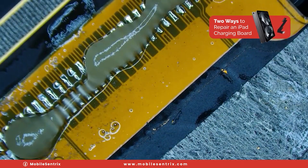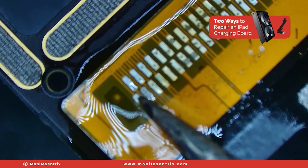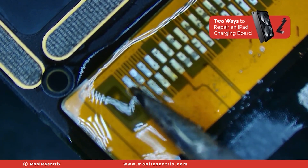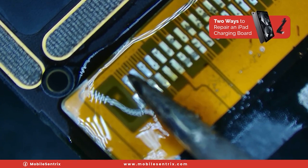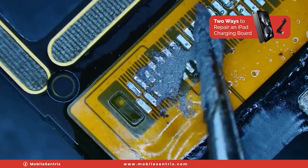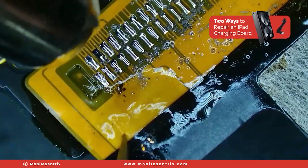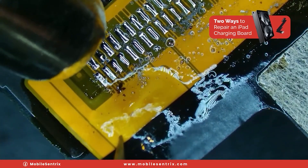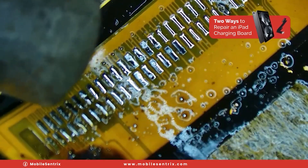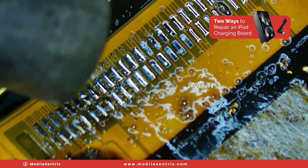I'm going to add some flux, then take some wick and really try to suck up as much of the solder as we can. Now I'll take tweezers, carefully go on the edge here, lift up the flex giving it a little tension — this will allow the solder to start to let go of the flex as we move along it. I'll add some low-melt solder again and leave a little bit more on it this time. With this low-melt on there it should come off relatively quickly. We're not going to yank on it — we'll take our time and it'll come up nice and easy, slowly and surely letting go of all of the pads with the help of that 138 solder paste.